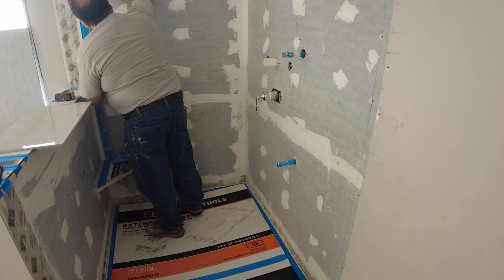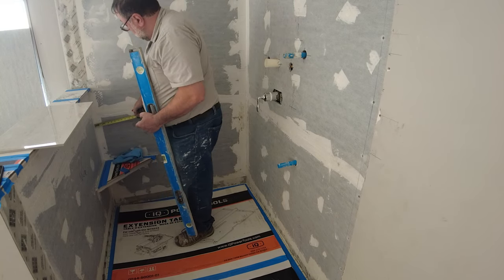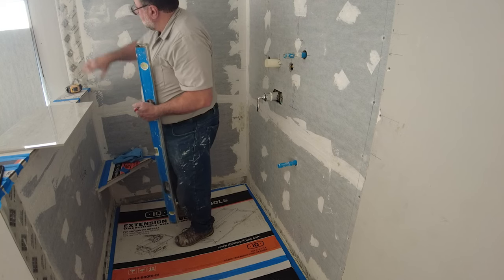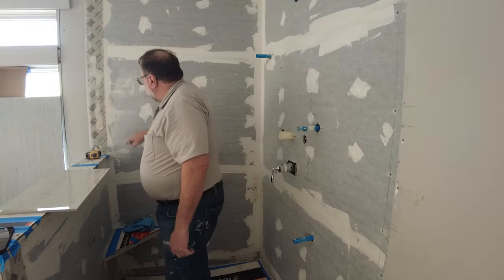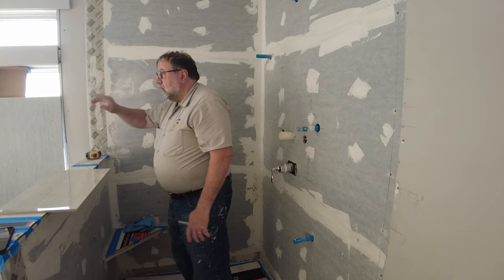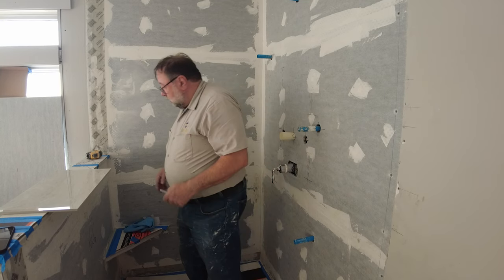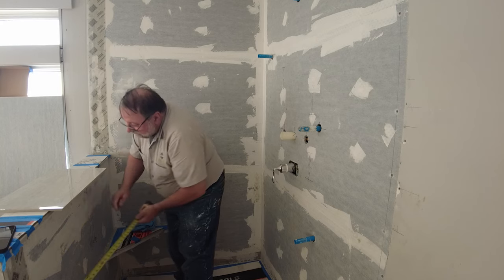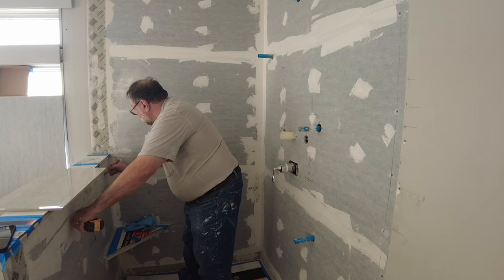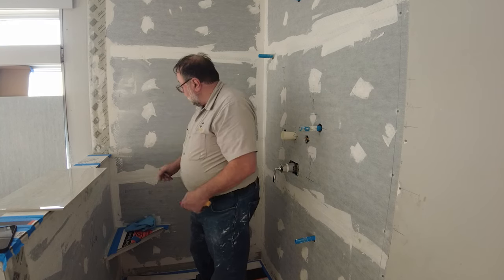This is all approximate — it's not so close that I can't use this layout. I'm going to get about a 4-inch piece down there. I want this piece to look nice because when you walk in the door you're going to see it. So I'm going to reference this piece to make sure it looks good, and the piece you're not going to see can be a little smaller. Typically you want no less than a half tile, but it's a matter of compromises. So from here it's 24, then 24.